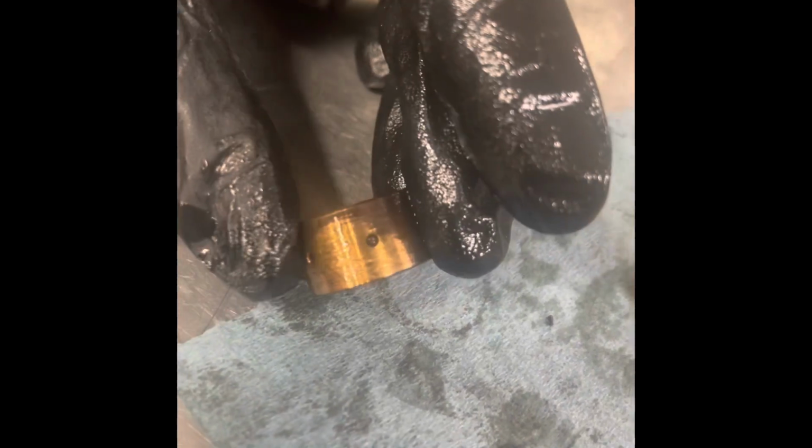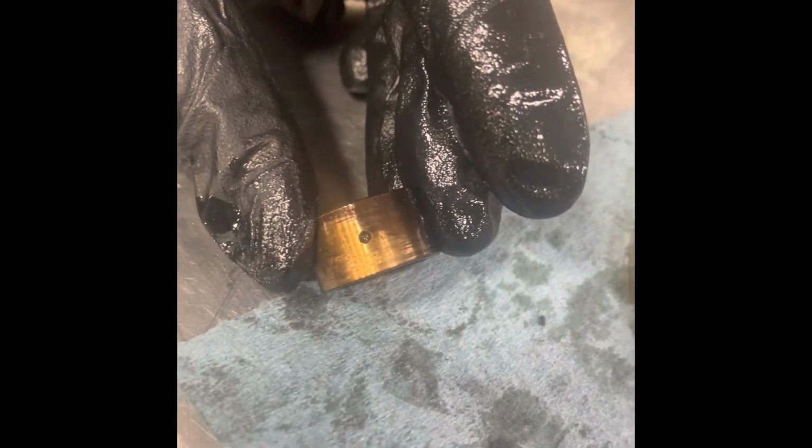So that little round circle mark that you're seeing, that deformity, once the contamination went around and kind of got the bearing hung up, that's the oil feed passage. Roll the bearing around there, Junior. You see how the bearing has pressure on one side, and right here it had light pressure on the other side. So basically a piece of debris got in here, pushed the bearing off to one side, got it hot, and it swelled up in the bore and seized.